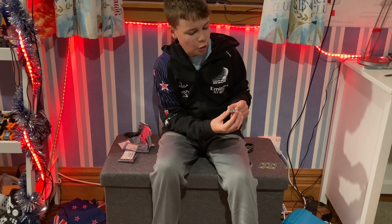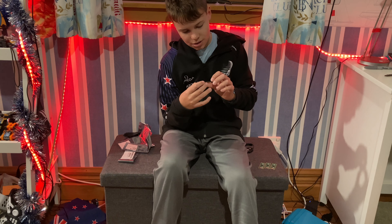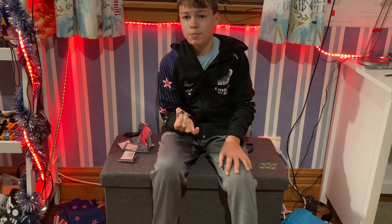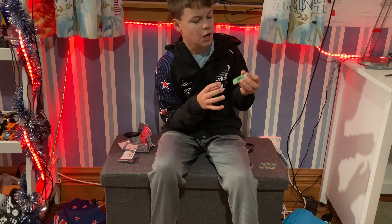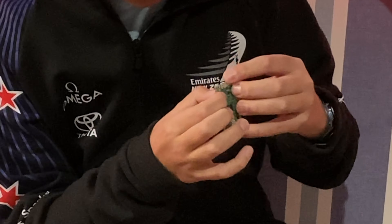That's Pico number four. You press and hold the boot select button to put it into USB mode so that you can actually put files onto it.